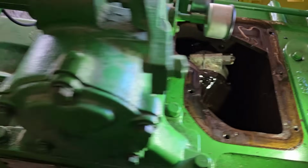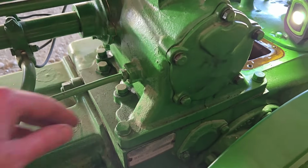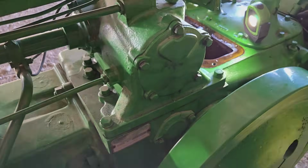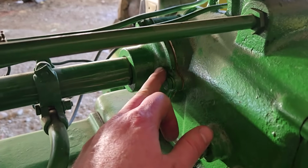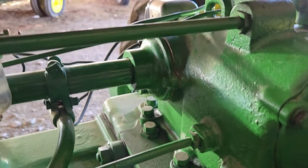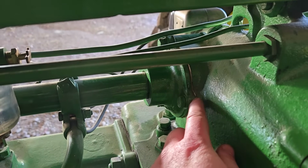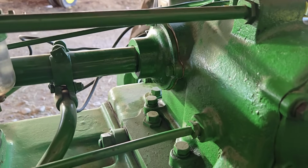Okay, so my dad and I have been talking about why this governor fan gear seems to be making sound. And our thought is maybe, well, first of all, it's cold. It's really cold out here right now. And it seems like whenever it makes that sound, it's always because it's cold. Secondly, that fan is on a bevel gear. And so the two bevel gears need to be at the proper engagement. There's supposed to be shims down in here that you can use to adjust the backlash between those two bevel gears.